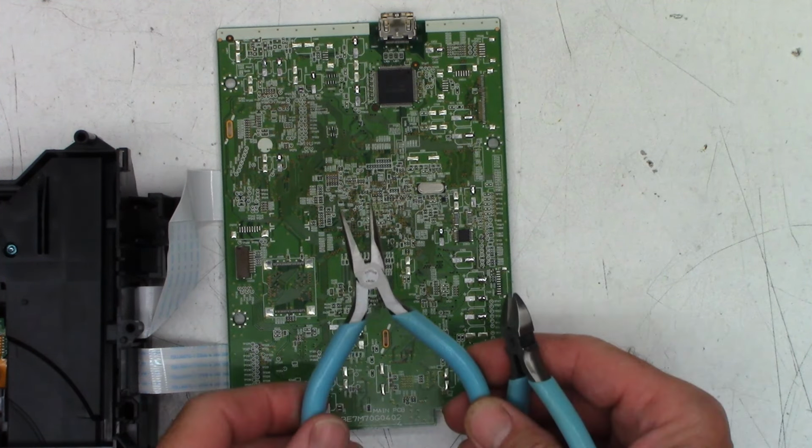And this will be the last 47 microfarad 6.3 volt cap that goes on the board. Hopefully you can see a little bit of that. Up a little bit better. There we go. You don't want capacitance between the capacitors. Although I don't think it's going to matter on this. It's in the power supply circuit. Mainly if it's in the super low level circuit like in the optical pickup amplifier, you don't want stray capacitance.